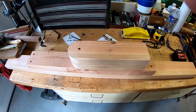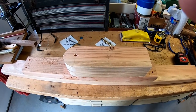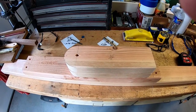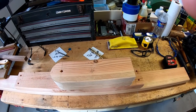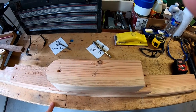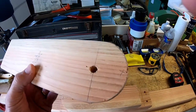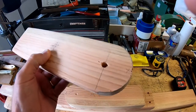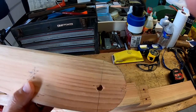This portion of the video is about jigs. When you make these frames for the cornhole boards, you want them to come out exact. If you measured and marked every board every time, chances are they won't come out exact. I like to make one board completely done and use that as a jig — I can pretty much toss my tape measure away. For the legs, start with a 12 inch 2x4, use your compass to draw a nice circle on the end, cut it out with your jigsaw, and drill your 7/16 inch hole for the leg.